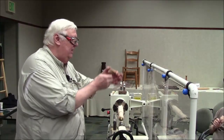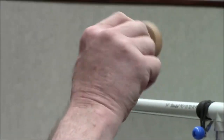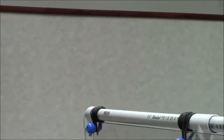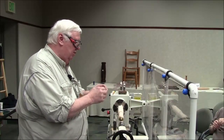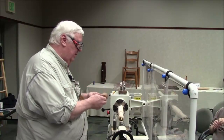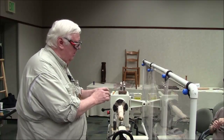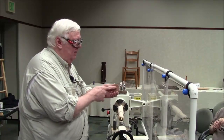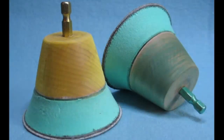It's not absolutely critical that it be so many inches here or here. It's just something that looks aesthetically well and it works for you. And so that's what you want to end up with. And you've got 30 cents invested in the drill bit, scrap wood, and you put it in, finish it like that. And when you're done with it, because this thing might have been in a little bit off, part it and true up the end and true up the top. You don't have to, but I want it to be right.